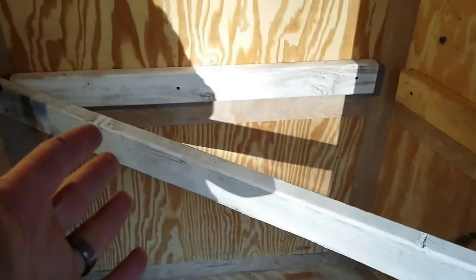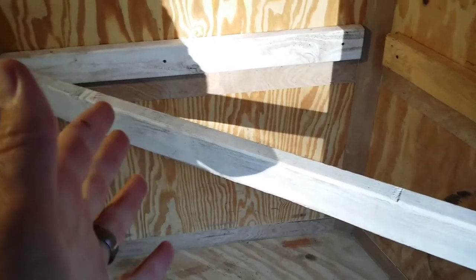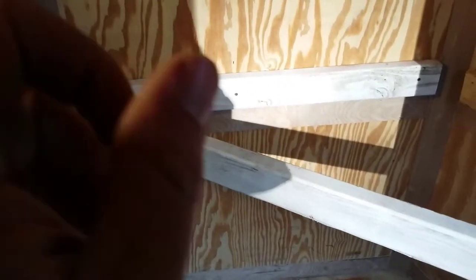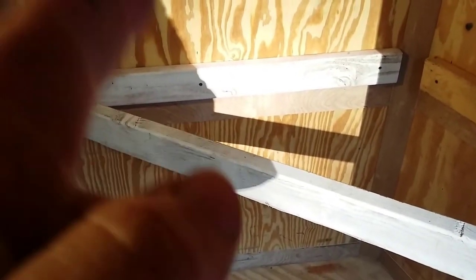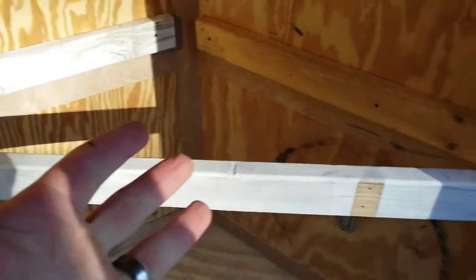For this one you just measure from the outside wall to there, and I've got two screws just into the corner of this board. If you're going to put crazy weight on here you may need something more substantial, but even setting a backpack blower up here, gas cans, whatever — this is plenty strong enough because it's a triangle, and the decking spreads the weight all around. Plus it's in the studs. These things are very strong. This is how I made all the shelves in my trailer — this is my fourth shelf. One in my old six-by-twelve with the big V-nose, and I'll put a link in the description to that video.